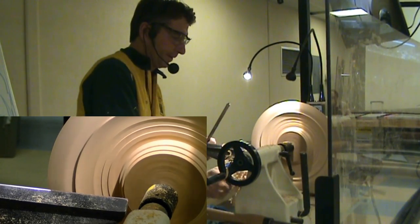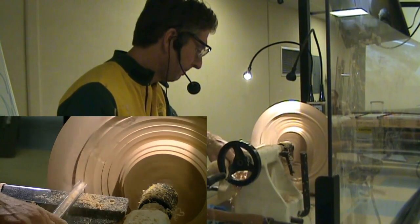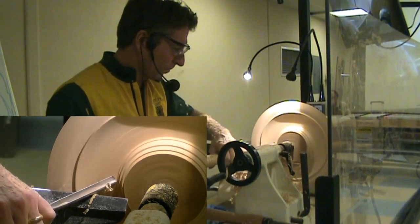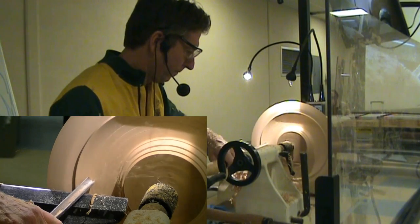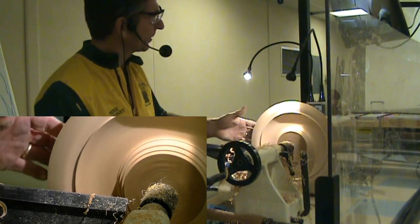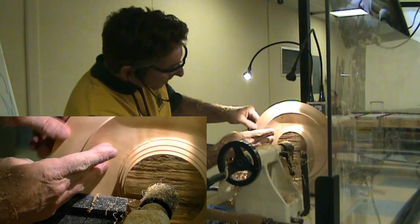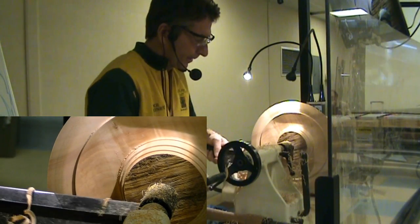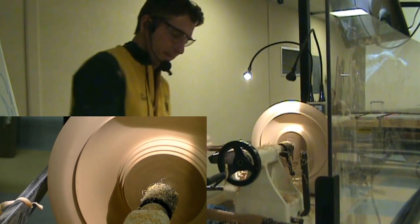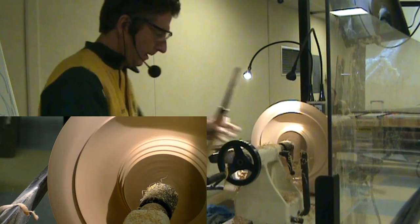Before I remove that bulk I'll finish this surface here. I'll check that curve — make sure all the wood's cut clean, and then I'll just remove out that whole interior bulk. There's a little bit of broken grain there — that's caused by the figure. I'm going to live with that because without any walnut oil, it's not going to go away. One other little detail I've missed — this little ridge here. That's taken care of.